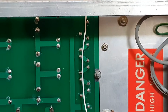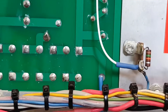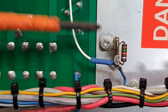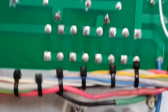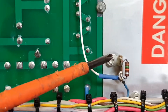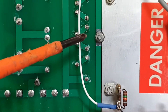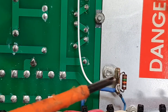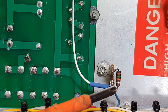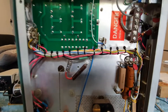This wire goes through hole J and connects to the non-earth side of the meter on strip J. If you remember we removed the string of four resistors which was in a tube - this setup does not require that. The wire connects to this lug, not that lug. I've neatened up the rest of the insides.